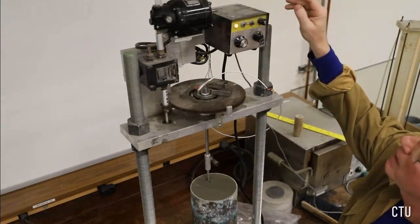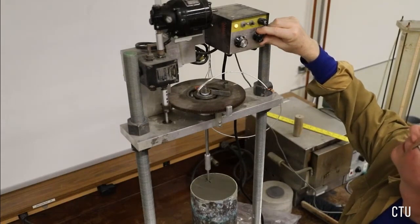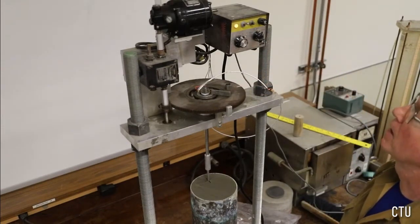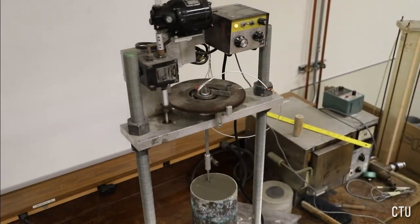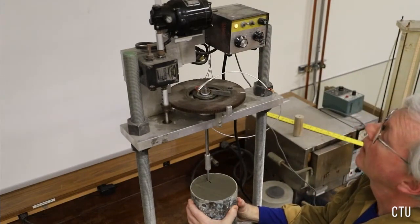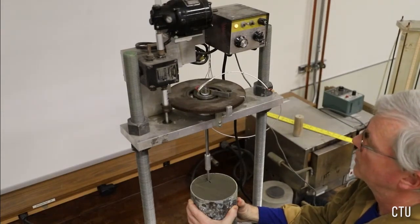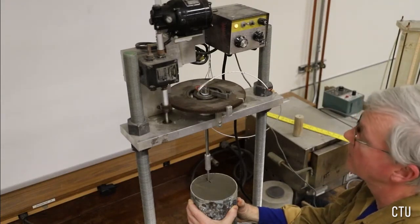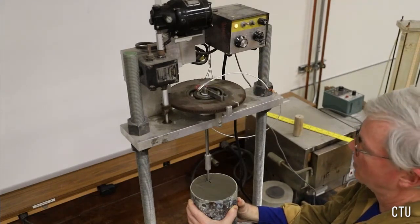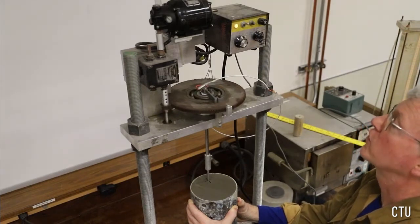And now we're going to power the motor and turn this in the forward direction. And you can see the block is advancing here on the bar. I'm going to hold the sample so we don't get rotation, and we'll run the tests. Contact. So now we're rotating the vane within the soil, generating shear resistance. It reaches peak very quickly. We'll talk about why, and we'll let this go on well past the peak with the torque dropping with time.